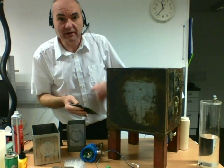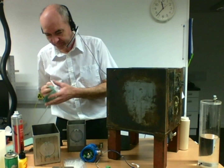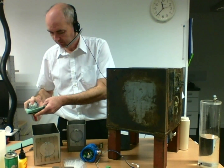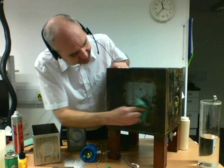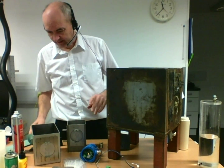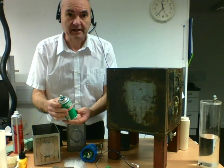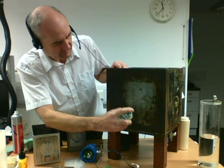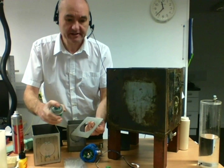You would have to do this for quite a while because this is quite a rusty old tank. However, I'm now going to use the solvent cleaner to clean off the dust. The next part is to apply the activator for the adhesive — that just sprays on. Good covering, and I would apply the same to the inside of the bracket.